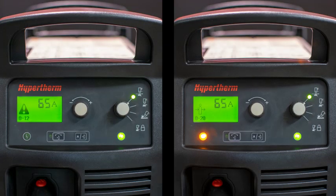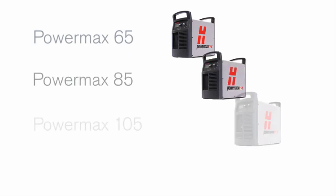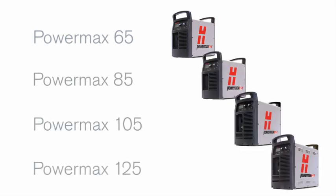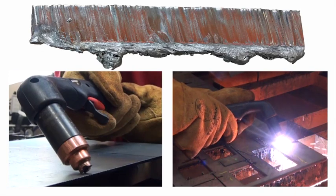This video will help you to identify the 012 low input gas pressure warning and the 020 low gas pressure fault for the PowerMax 65, 85, 105 and 125 models. For these PowerMax models, the symptoms of a low pressure warning can include poor cut quality, slower cutting speed, or the arc misfiring.